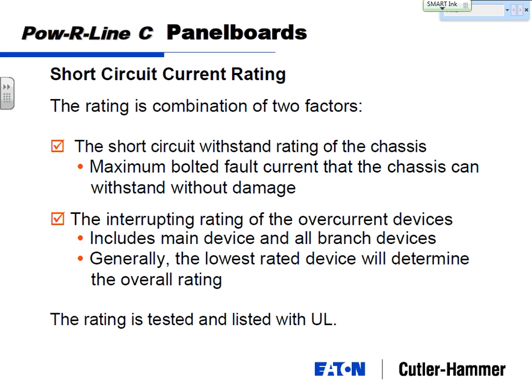What is thermal protection? Thermal protection is overload protection. Thermal meaning an overload. Like if you plug it into the wall and you run a little higher than what the rating is, whether the cable or the circuit breaker, you're going to gradually increase the heat. Everything's going to get a little hotter before something tells it to trip. What the circuit breaker is looking at, it's actually got two pieces of metal on the inside. Bimetal. It's a bimetallic type system. Those two pieces of metal have different coefficients of expansion. And when it gets too hot, one of them is going to bend until it hits a trip bar that's going to tell this thing to trip. And that would be the thermal part, or the overload part of the trip unit.